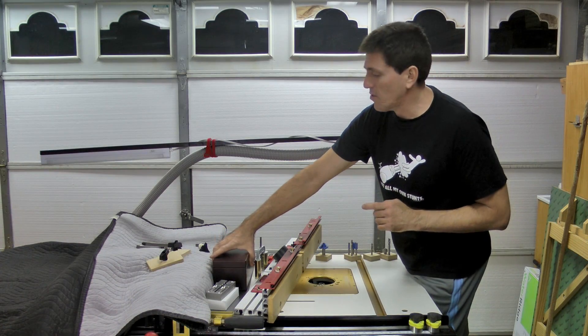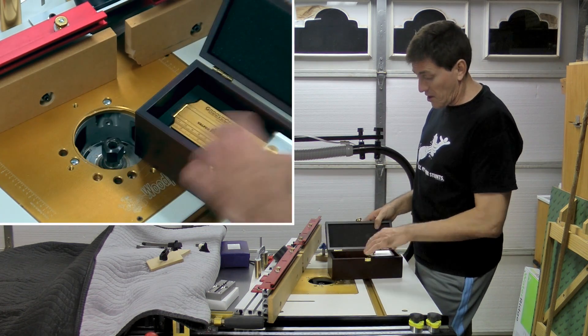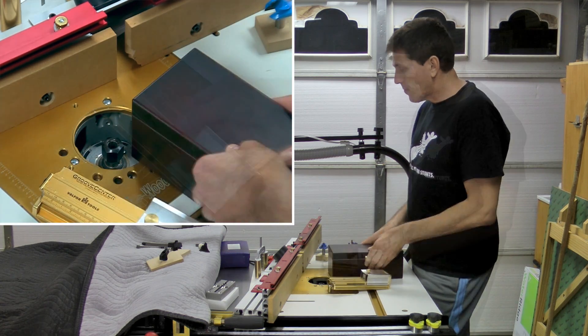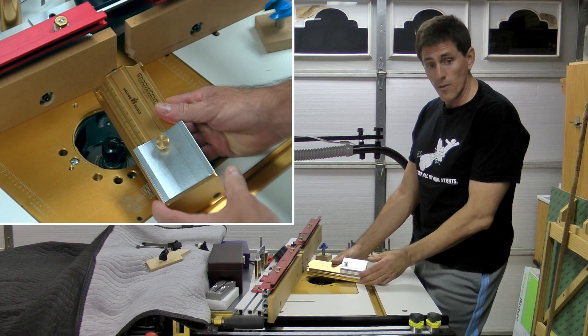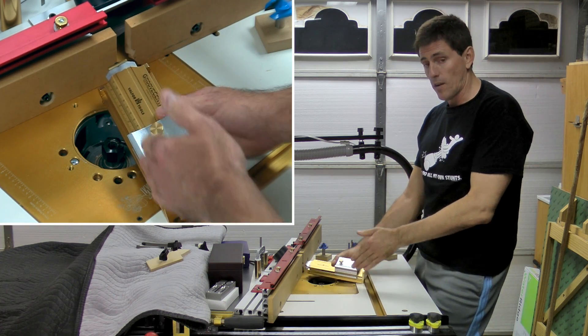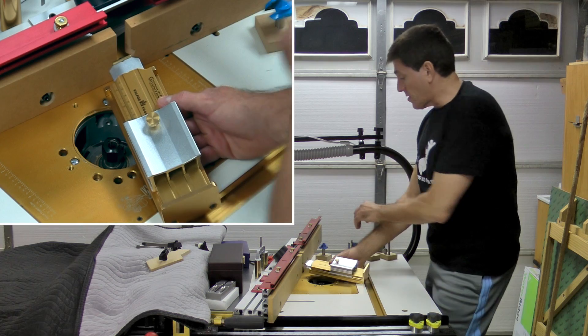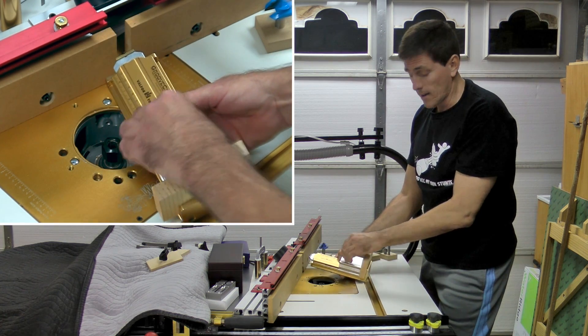So let's go back to the groove center. It comes in a really fancy box with a nice fitted interior, so a good place to keep it as opposed to tossing it in a drawer. What this setup tool is used for is basically taking a measurement of a piece of stock that you want to center the bit on, whichever type of bit you've got. So you would put a piece of stock here, slide the jaw shut, and lock it into place.